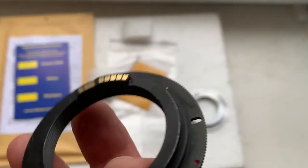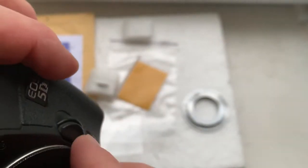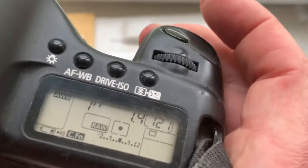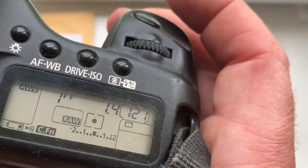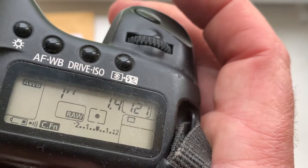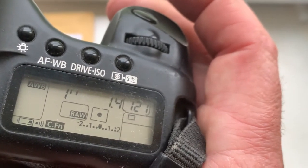And chip number 2. Also pre-programmed: focal length is 85mm, aperture 1.4, delay time to enter in programmer mode is 1 second, focus trap mode is off.